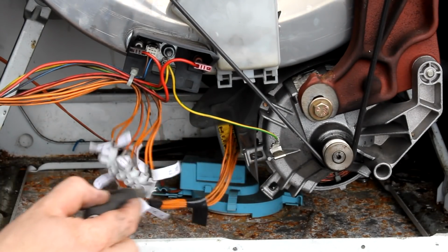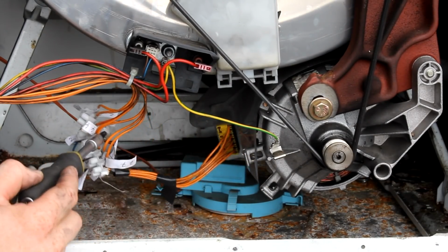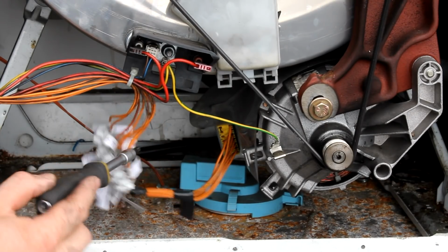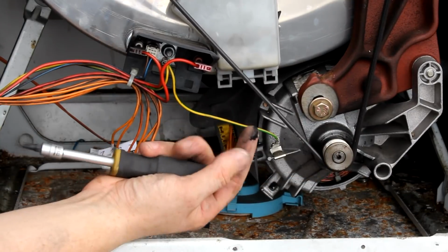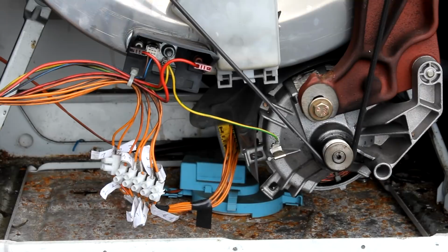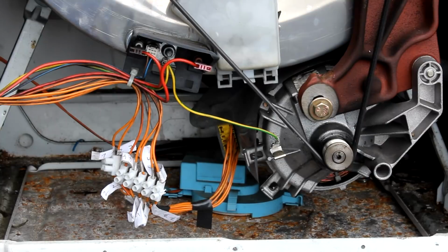And here you can see a bunch of clamps and stickers, and they are not part of the original equipment of this machine. I added them there a couple of months ago because I measured both the waveforms and the voltages across the field winding and the rotor winding of the universal motor in order to learn more about the exact mode of operation that was used here to control the motor.